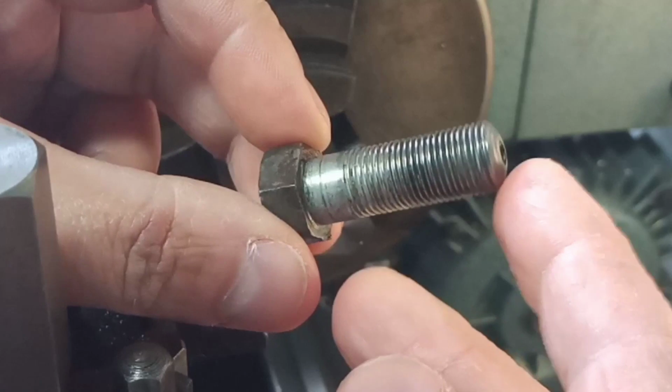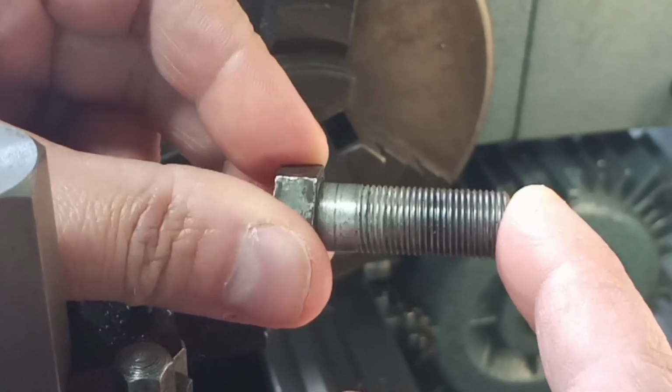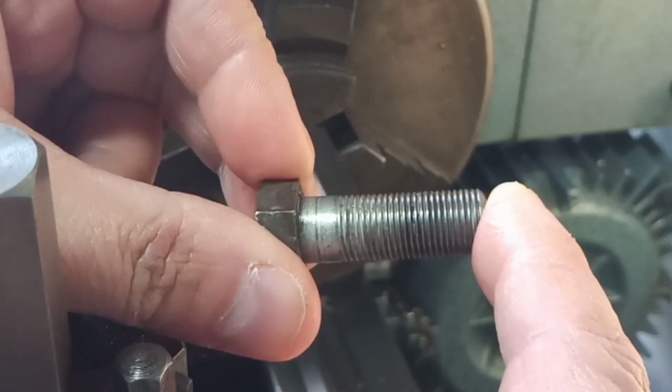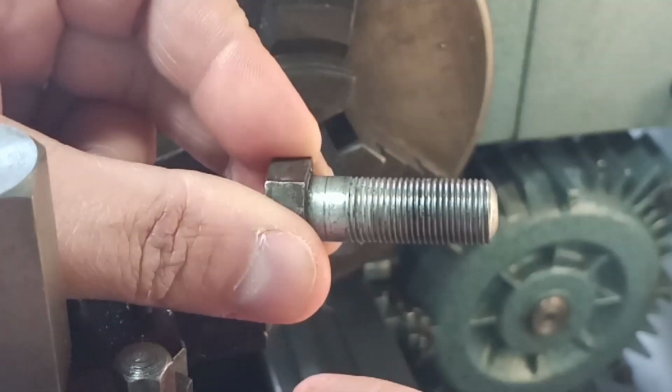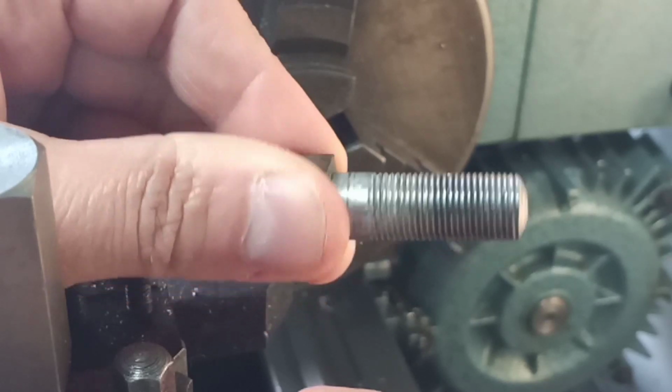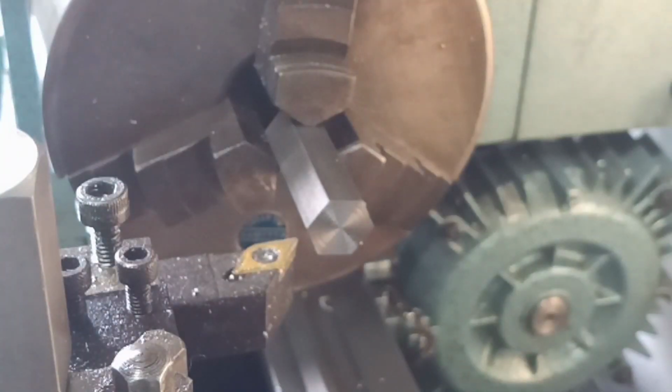And then once we've got 2 blanks made, we'll put the gearing on the lathe with the sinister, mysterious universal quadrant, and we'll cut our 20 TPI UNF thread, and that should be us done. So yeah, we'll make a couple of blanks and go from there. I won't show everything, I'll just show you the salient points.